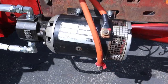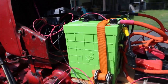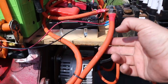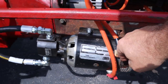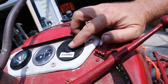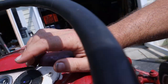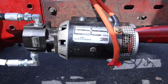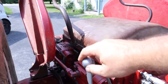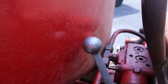On the side here I have a 12 volt hydraulic pump — unfortunately it's a little noisy. I've got that running off of a pretty good sized 12 volt battery, connecting to a contactor that then sends power down to it. These two hoses go up to where the original connection was for the hydraulics. I've got a switch set up on the dashboard — so this turns the hydraulics on and off. Like if there was a loader on here, these would operate the loader, and on the back the three-point hitch control lever raises and lowers that.